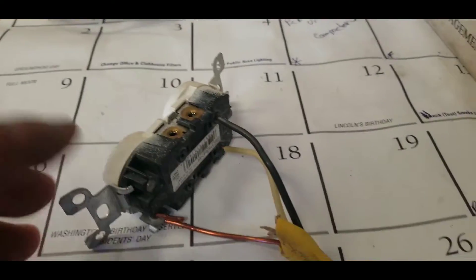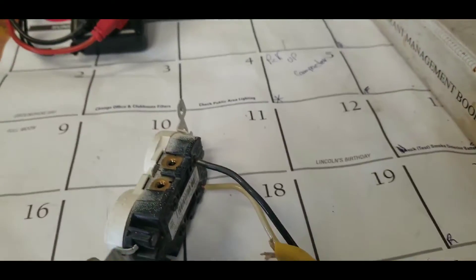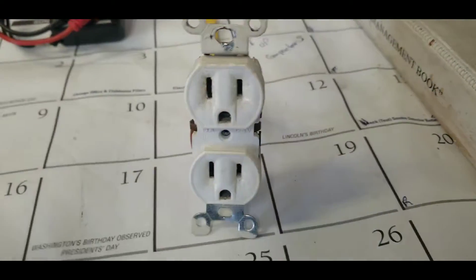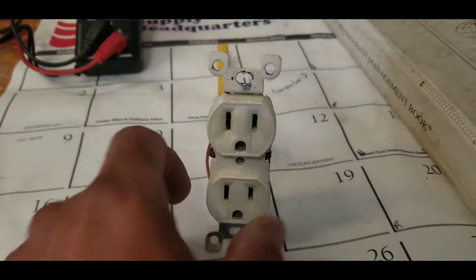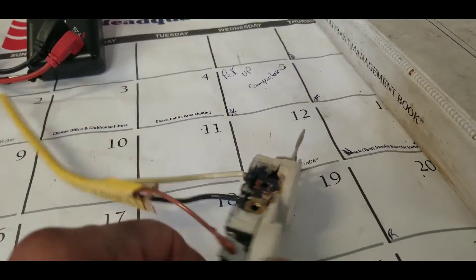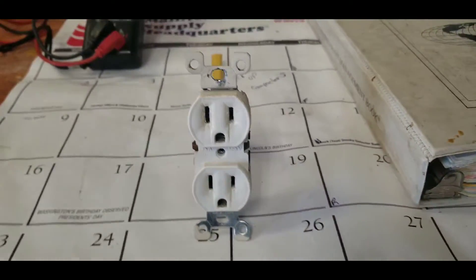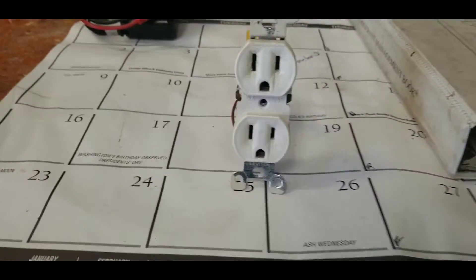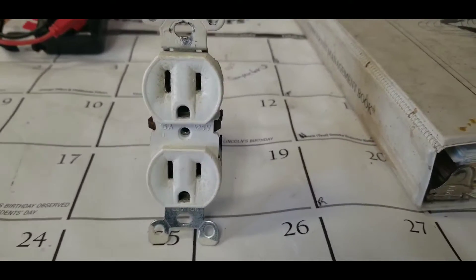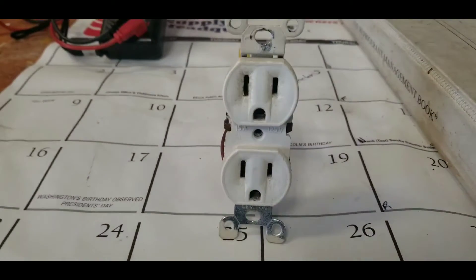This was in the dining room. There was a wire connected feeding all the receptacles. One of them was feeding the fridge, which is wrong — you shouldn't run a fridge direct from a 20-amp breaker to a shared outlet. Major appliances like your fridge and dishwasher should each be on their own 20-amp breaker.